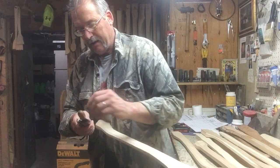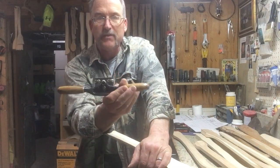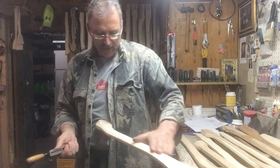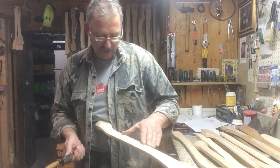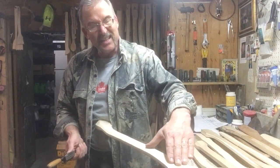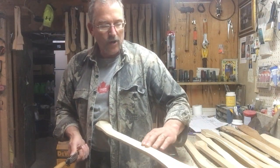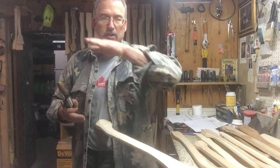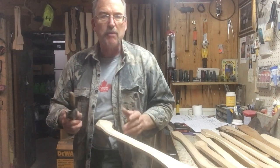I've done this before, but in case you haven't seen it, this is my spokeshave - it's a Lee Valley flat spokeshave. Works really good. If I look at this handle, I can see the grain is running pretty much straight along the handle, but it's down a little bit. I've got one grain coming out here and then a couple coming out here, so the grain is actually meeting. This handle had a little sweep in the growth rings - just minor.